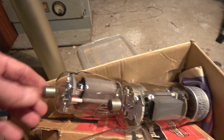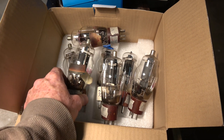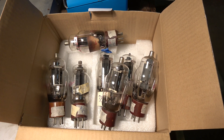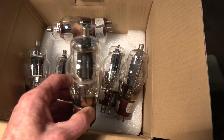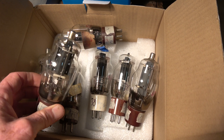There are the usual shaped plates as well. An 807 has 30 watts plate dissipation, so four of them gives 120 watts — not much less than the 813. Although at 750 volts maximum you can get maybe 50 watts out of one; it's really pushing it. More likely 45 to 50 watts at 600 volts.